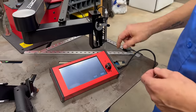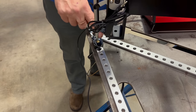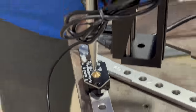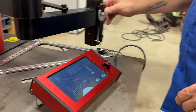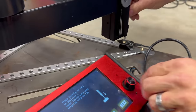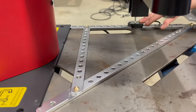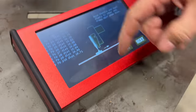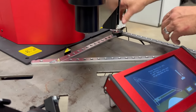The sled's plugged in and the stylus is on but not plugged in yet. This stylus has a hole in the tip, and so does the plasma torch — the only thing common to all plasma torches is that hole in the middle. That's what we're calibrating to. Lower it down onto the point so the sled and pointer are together, then slowly move it along the rail. It picks up on a bunch of reference points as it goes, then you do the other two rails the same way.